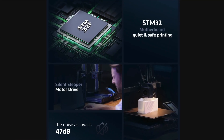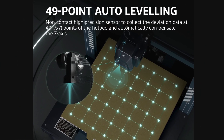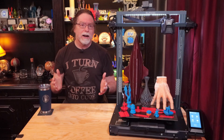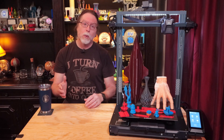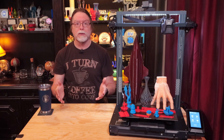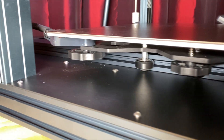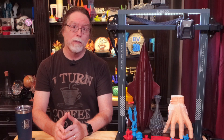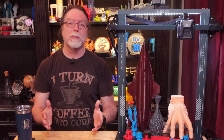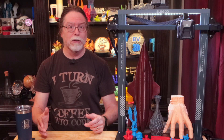It has a 32-bit mainboard with silent stepper motor drivers. It features automatic mesh bed leveling, and with a bed this big, it's probing 49 points in a 7x7 grid. Like a lot of printers with a mesh leveling sensor, it still requires you to manually tram the bed to get it mostly level, and the center of the bed is fixed at a specific height, while the left and right side each have three adjustment knobs. So instead of one adjustment knob at each corner for a total of four, the Neptune 3 Plus has six adjustment knobs. These are used to make sure the left and right sides are flat and at the same level as the center of the bed. It's interesting, but it does work.